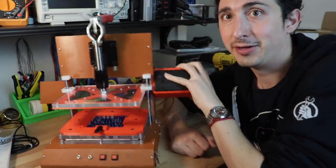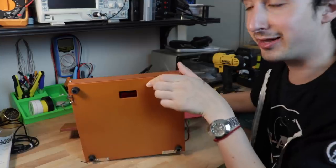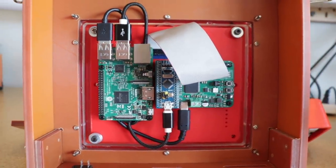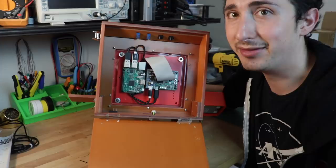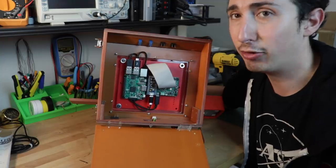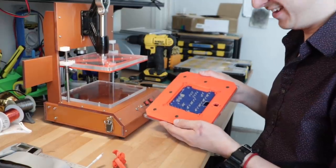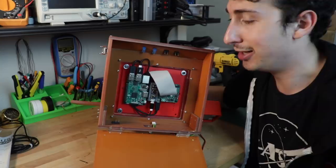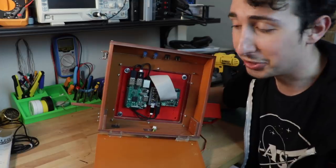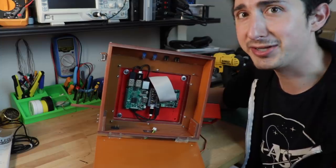The label printer is installed now and it's really not going anywhere. Mechanically this is going really well, and what's also nice is how clean the electronics came out. Everything pretty much rides on the underside of that platen, which is great for serviceability. If we wanted to update the electronics, all we have to do is pop out the 3D print and the acrylic — it'll all come out as one piece. Nothing's actually attached to this red-brown programmer jig, only that platen. Everything smart that we built will come out as one piece, letting us service and upgrade them really fast. It also keeps this jig universal — it could receive a different 3D print for a different type of board in the future, and we won't have to customize the PCB programmer fixture. We'll just keep designing new platens.